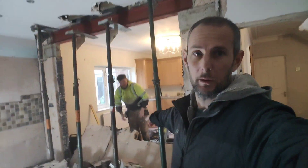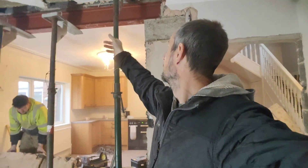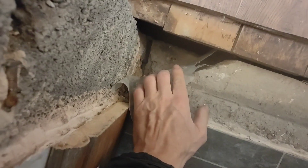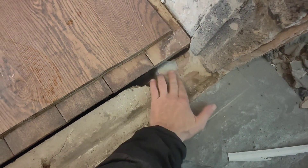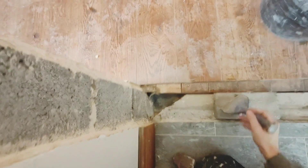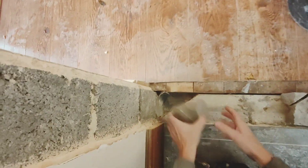It's the next day. Tim's been getting that wall down and I've just been with Josh to pick some blocks up. It seems to have gone off overnight, so we're all good. We'll get this wall out of the way and then we'll take the props down when we're not banging about, just to make sure. This is what I've got to brick up this doorway over here. It's got a concrete pad from this floor, some plastic, and it's actually got a wall under there, so it's good to build on. I'll just fill that in then we'll build up.